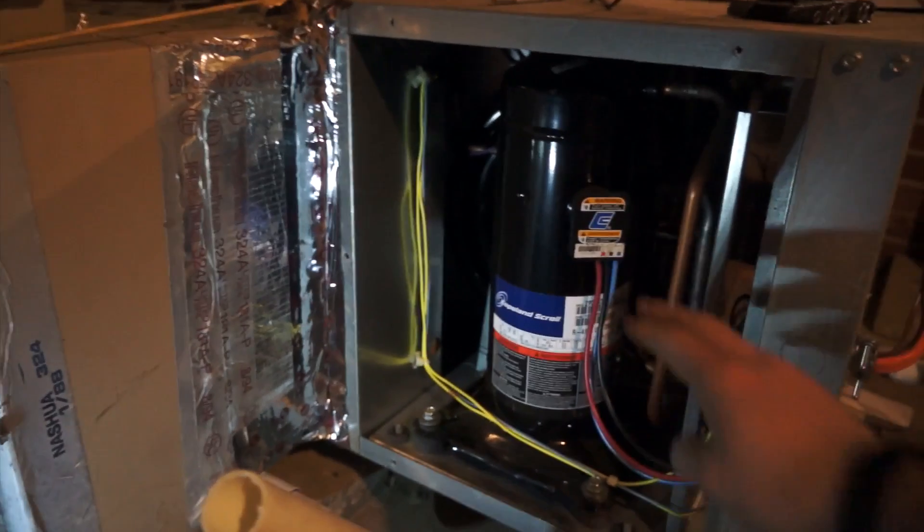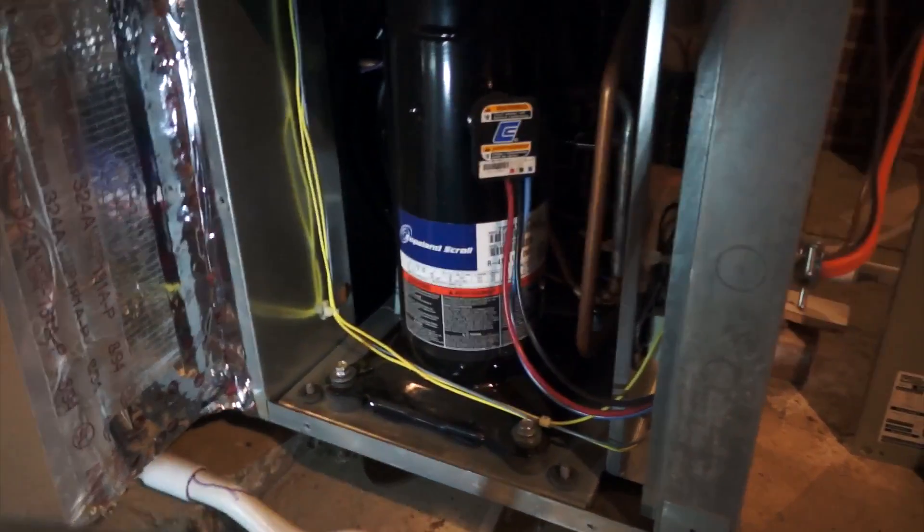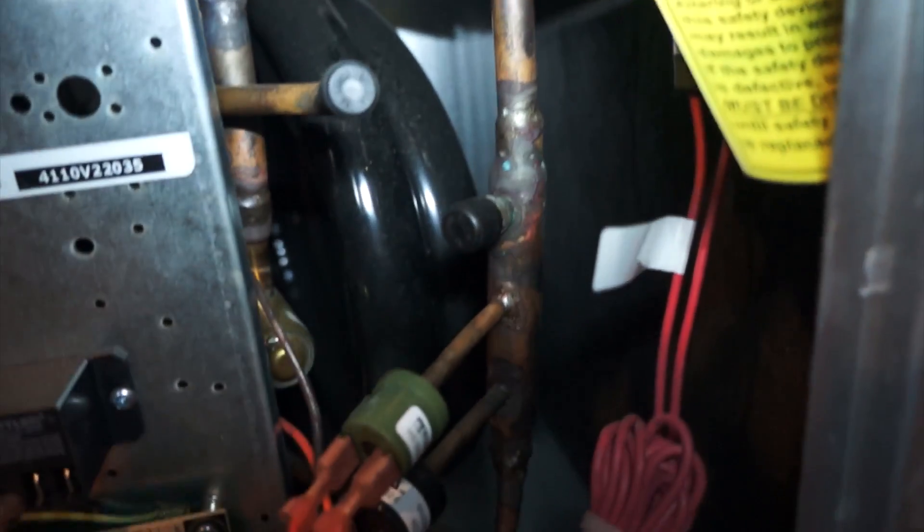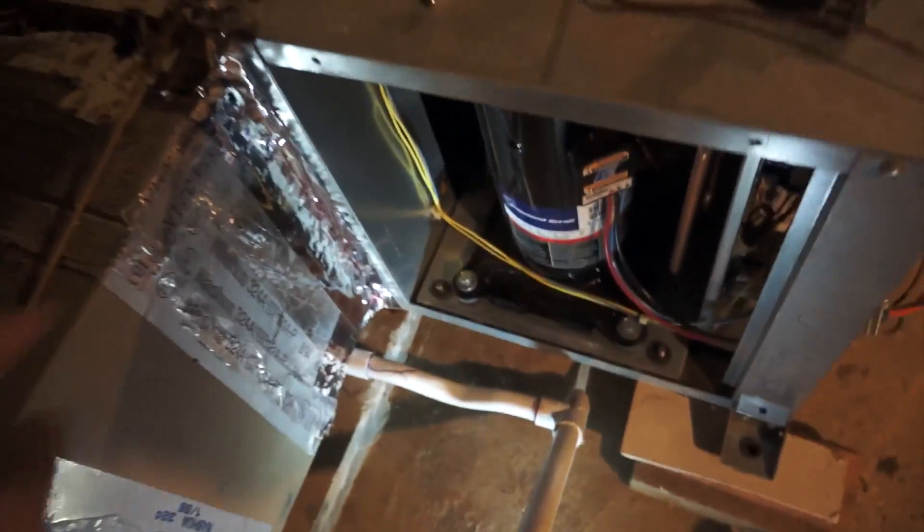Let's open up the unit and see what we have going on inside. The heart of the operation is obviously the refrigerant compressor, which pumps the refrigerant around through all of the heat exchangers and all the other ancillary control hardware. Behind the compressor you can see a little bit of the refrigerant-to-water exchanger — it's a coaxial coil exchanger. If we move around to the other side, you can see the other half of that exchanger; it's the black piece that's curled up like a tube. You can see the copper line comes to the water out port, and the other end goes to the bottom where the water comes in. The refrigerant-to-air exchanger on the other side is the part which actually heats or cools the air of your home — that's where the return air comes through, and it just looks like a regular radiator.